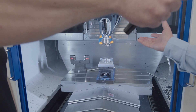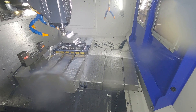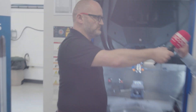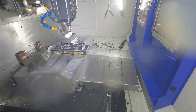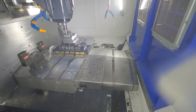We're using the 80mm diameter face mill to face the part, then to rough out the front area we use a smaller insert from the same Do-Feed family — the 06. We also have an 03, and that 40mm 03 cutter takes out what the 80mm can't reach. Then we have a new addition to the range: the Add Do-Feed, a new smaller 02 insert. That's the 10mm cutter doing all the pocketing on the top, running at nearly nine meters a minute feed rate — quite a substantial feed rate.